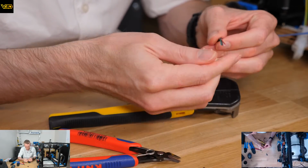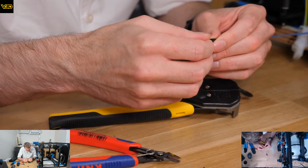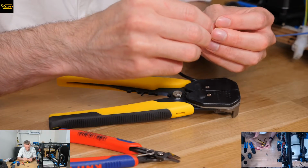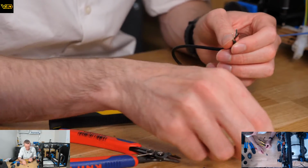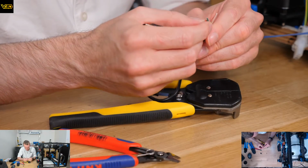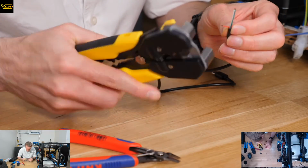So yes, this is USB 2 type wiring, as Lars says, rather than anything fancy. The other theory behind that, or the problem with that, is that with USB 2 style we would normally be limited to 500 milliamps. I know that was the rating for normal USB connections. Now we want this to carry 3 or 4 amps, which is 8 times 500 milliamps. These are really quite thin wires, so that does concern me somewhat.